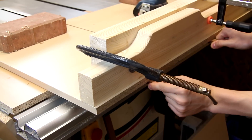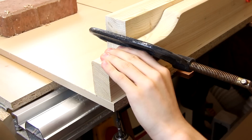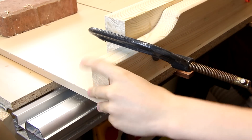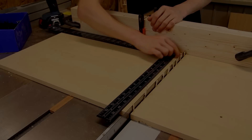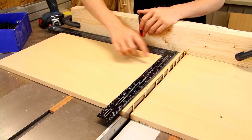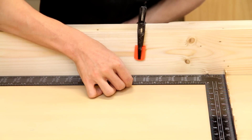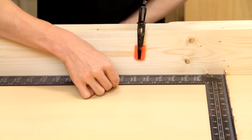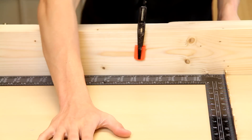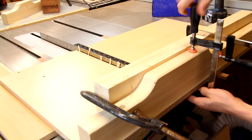I pull the sled past the front edge just slightly and drive a screw up here on one end — I've already drilled a pilot hole for this screw. I've just wedged this steel rule into the kerf left by the saw blade, which gives me a far better surface to reference against than just trying to reference against the saw blade alone. Now I can butt this framing square up against it, and because of that single screw I can pivot the fence to the point where it's just in square. When I think I've got it about right, I slide it carefully off the back and clamp it down to drive another screw.